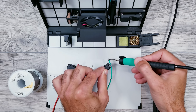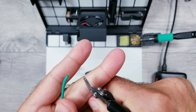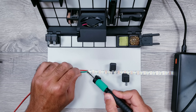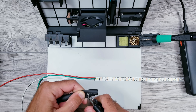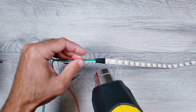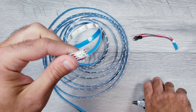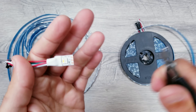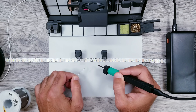I already made a couple of how-to-solder videos with close-up footage and detailed commentary, which I'll link in the description. Learning to solder for LED projects gives you so much more freedom because you no longer have to rely on finding a perfect solder-free connection. I'll use a little heat shrink tubing to reinforce the connection and give it protection from moisture. Since I know one 5-meter roll isn't going to be long enough for either side, I'm going to solder another 5-meter roll to the end of the first one — cutting off the last LED of the first roll and the first LED of the second roll, then connecting them. Make sure to watch the arrows on the strip to ensure they're all going in the same direction, away from whatever controller you use.